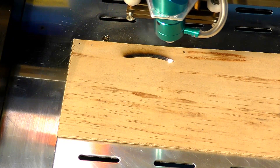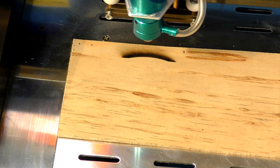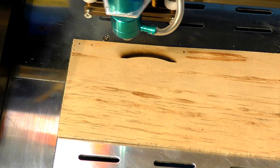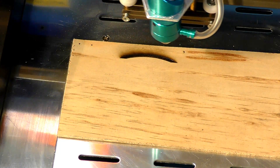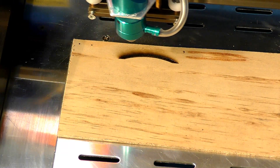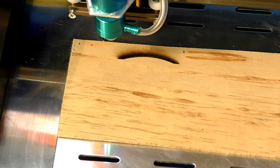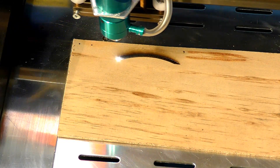I think you'll agree that is way too much power for a raster engrave, so I'm going to stop it and get another bit of material. It's the first time I've actually done a raster engrave with this laser and it's digging in about probably a millimetre — way too much power, or maybe we're going a little slow.